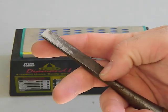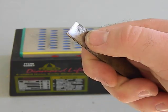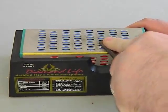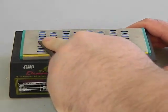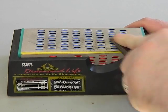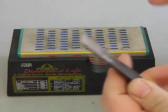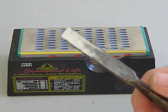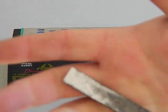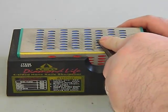As you can see, I already took off a lot of material. It's probably the chisel that's not level as opposed to the diamond. We can see in a matter of a couple of minutes it should be nice and flat. You can use this for knives, you can use it for tools — I like it for tools. I don't really like using something like this for my knives, but for something like this, a beat-up $6 chisel, no problem. We're already making good progress, even in a couple of seconds, smoothing out and flattening this back.